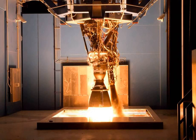On March 10, 2009, a SpaceX press release announced successful testing of the Merlin vacuum engine. A variant of the 1C engine, Merlin vacuum features a larger exhaust section and a significantly larger expansion nozzle to maximize efficiency in the vacuum of space. Its combustion chamber is regeneratively cooled, while the 2.7-meter long niobium alloy expansion nozzle is radiatively cooled. The engine delivers a vacuum thrust of 411 kN and a vacuum-specific impulse of 342 seconds.